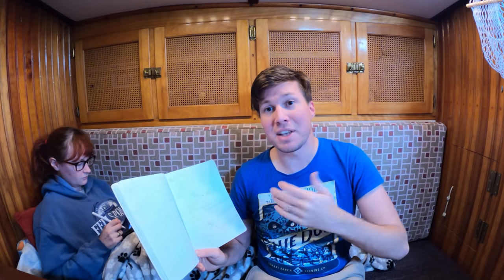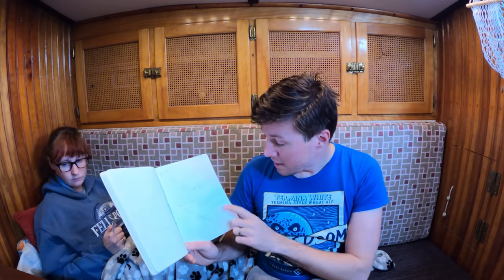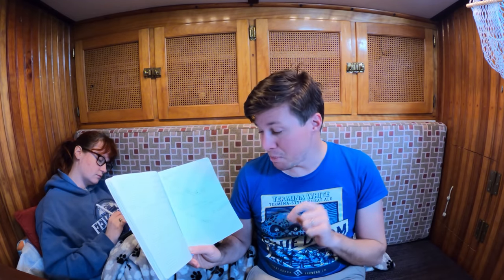If your stay is a little short, add some more toggles; if it's a little long, take some toggles out. Always plan to have a couple of toggles so you can add or subtract them and save yourself a lot of hassle. We're using two toggles so we can add or subtract two, giving an additional 4.5 inches of play. That means our five inches of throw in the turnbuckle now becomes nine inches of throw — a little bit of buffer.